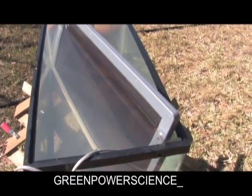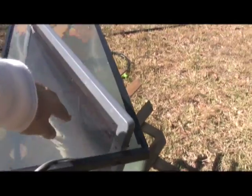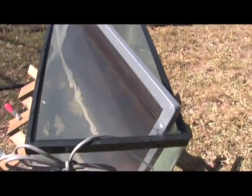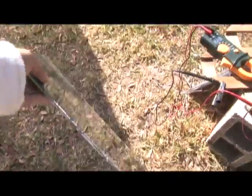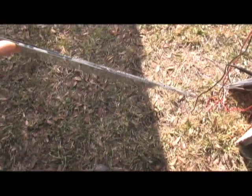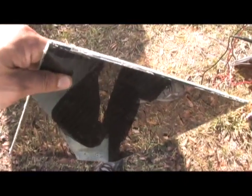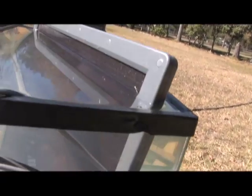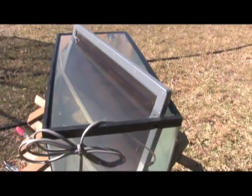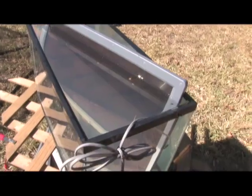I've had this in the tank for a little over a day and nothing's happened. You'll notice this tank isn't deep enough to totally submerge it, but I flipped it around. Here's the panel close-up — this is the one I destroyed. You can see you can't get that glass apart without breaking it, so that's your seal right there. The wiring goes in here and it's been sealed pretty well. You also have the gray gasket around it, which is basic plastic, but inside is a very thick bead of silicone that goes all the way around. So you basically have two layers of silicone protecting them.